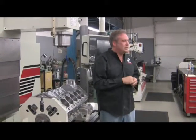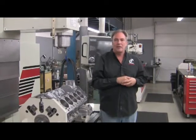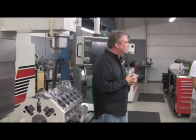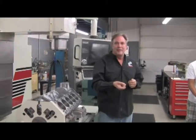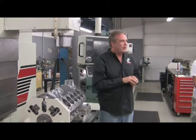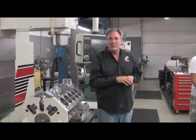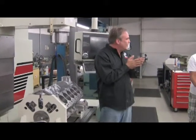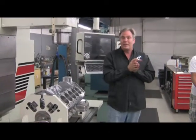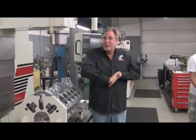Now, Mahle makes a piston. The piston has a ferrous steel coating sprayed on the piston skirt. They actually acid wash the piston skirt, and they spray iron on it. The reason they do this is you can't have similar metals. Similar metals want to bond when you rub them together at high speed. If you rub steel against steel, they weld themselves together. It's called friction welding, actually. It's a methodology of welding, of making two parts spin against each other really fast until they bond.